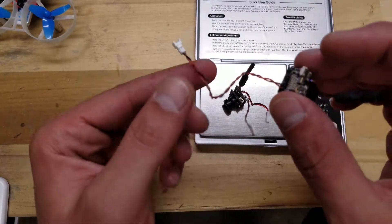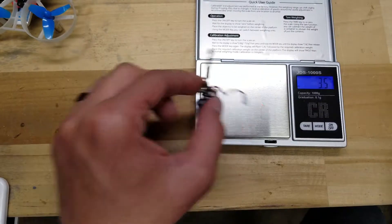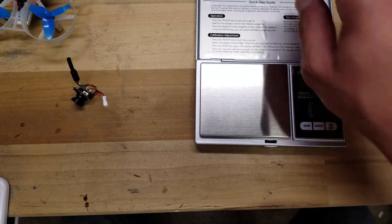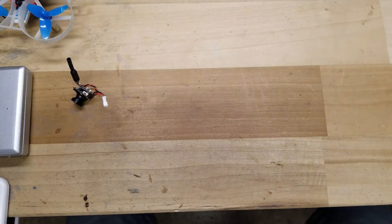It's probably due to this really, really long power lead they give you. So it's fairly light. This one does NTSC and PAL. The PAL resolution is 720x540 and NTSC is 640x480. The lens angle is 120 degrees, power consumption is 200 to 215 milliamps, and it can do voltage from 2.9 to 5.5 volts.